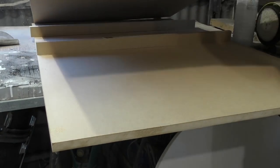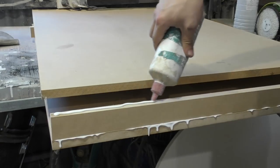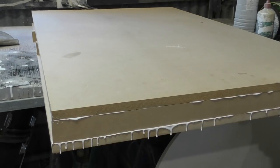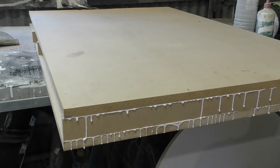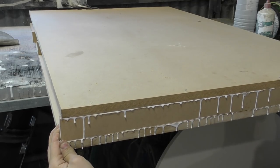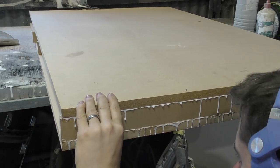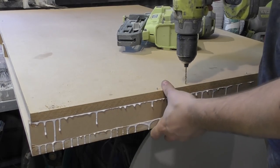Now, I always envisioned a panel that goes in between both of the pieces, because I didn't really want to be looking at the bare steel that goes in between the concrete layers, and I think this would just give a very nice polished finish. So I basically got some MDF panels and made up a nice little panel that goes between it. There's nothing overly complicated in here, it's just basically lining them up, making sure it's all square, and then hot gluing the two of them together, and then finishing it off, making them nice and round, and then paint.